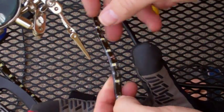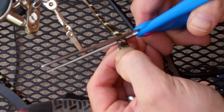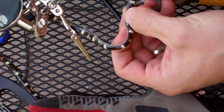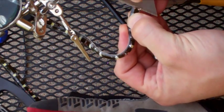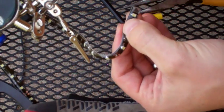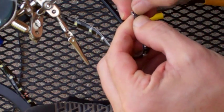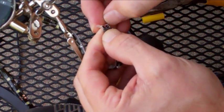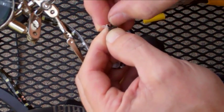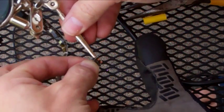I've got a little fan going to blow the soldering smoke out of our faces, because you really don't want to breathe that stuff in. Every three LEDs you can make a cut, so let's do that here. You can just do it with any old household scissors. Then take your razor blade and cut away the silicone the same way, clean off the excess, and expose the leads on the LEDs. Grab with your alligator clamp.